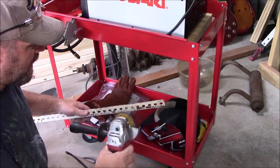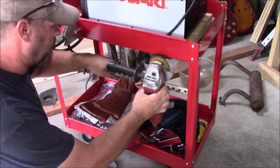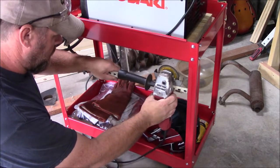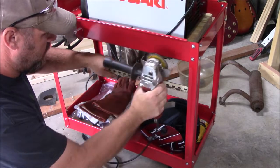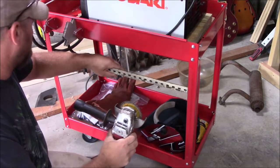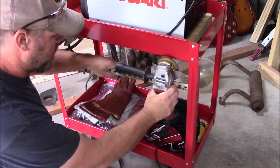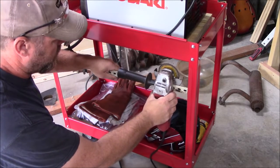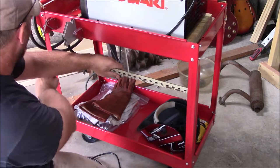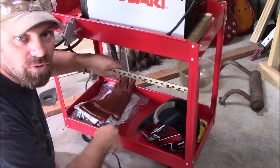For my grinder, I want it to go on the outside. We're going to hold the angle iron on the inside up kind of high, but not too high — we need to be careful because of this piece here. We want to position it so we can get the grinder in and out without it being too tight or too low. Right about here is perfect — it goes in and comes out. So we're going to drill a hole right here, drill a hole right here, make sure it's level, put two bolts in, and that'll be our grinder holder.